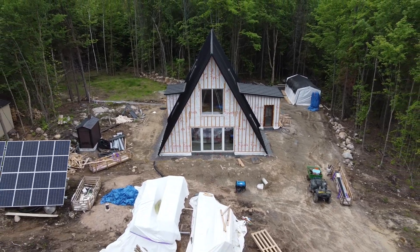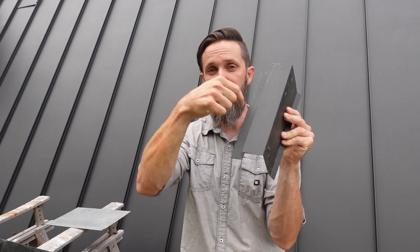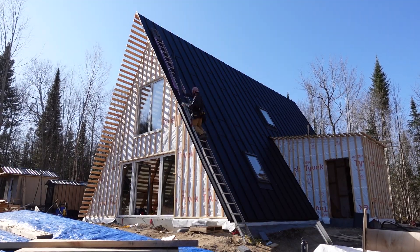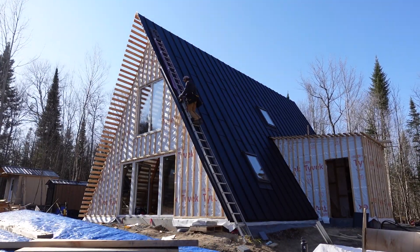The third section is the two gable ends — on both far ends of your house where your steel roofing meets the very edge. Same as with the sidewall, you want to make sure that piece of steel is not cut square. Put a bend in it so that if any water gets in behind the trim it's directed straight down to the very bottom of your roof line. Once you have that piece of steel on, you install the rake trim — this part goes onto the outside edge and gets fastened onto your steel roofing itself, screwed directly into the strapping, preventing any water from going over the edge.